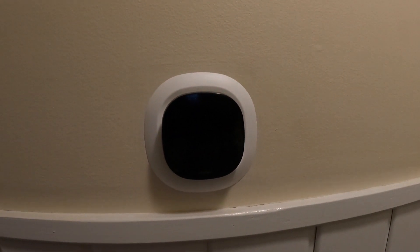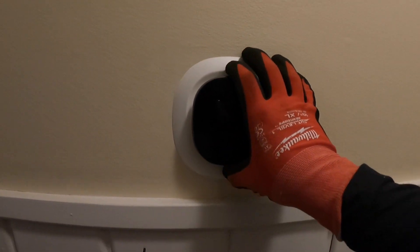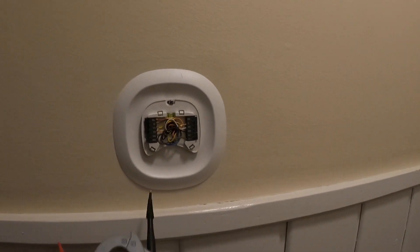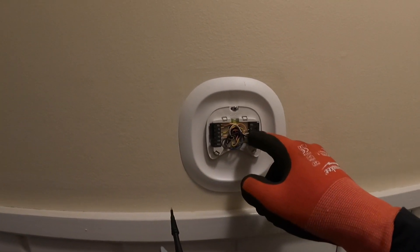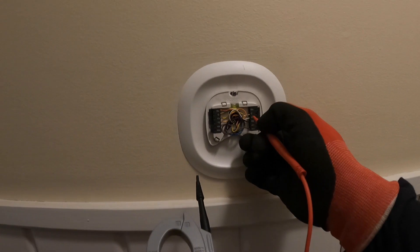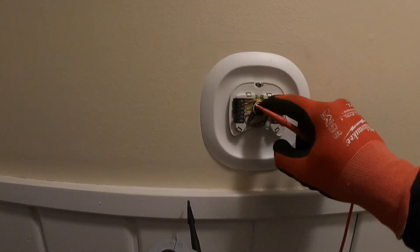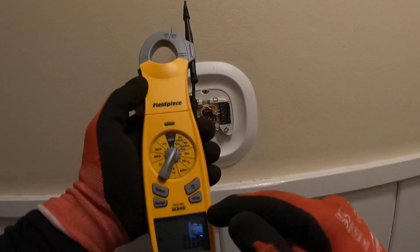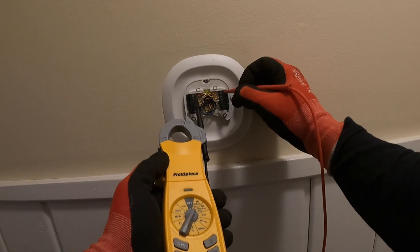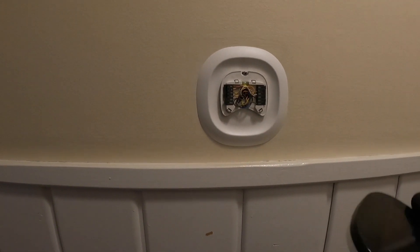Just trying to help the trade and help people who are getting into it learn something on their own time. Alright, so we got this blank thermostat. We're going to work backwards here — make sure, see if this has power. You've got your transformer out in the unit. This system is 240 volts, so it should be producing 24 volts between the R wire and the C wire. Voltmeter set to VAC and we're getting nothing, so we're going to move to the system outside.